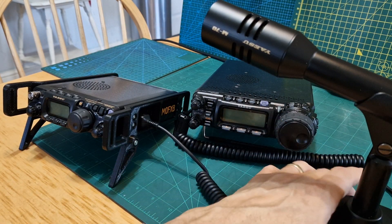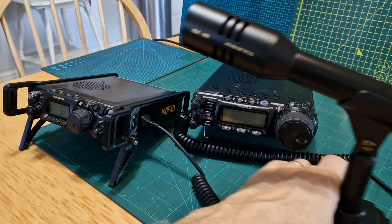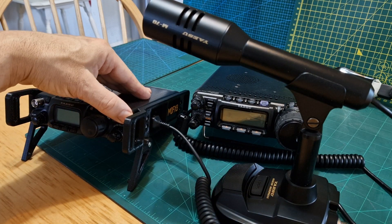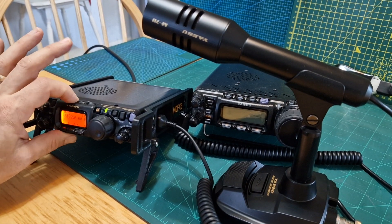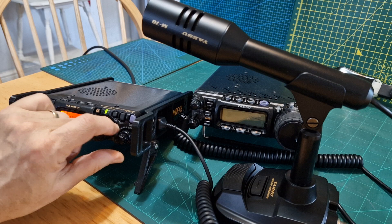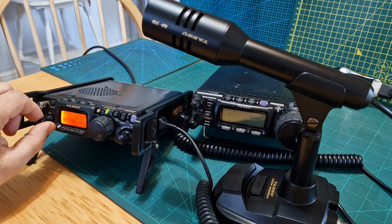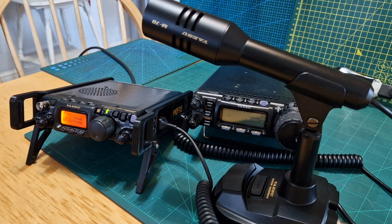There's a certain feeling that you get when you use them — it's not like using the brand-new 710, it's a different experience altogether, but still very nice and a lot of fun. So we'll just plug that in there. Turn on the 817. Let's get an antenna on there. We'll go up to the sideband on 40 meters, turn it up, make sure we've got the rear antenna selected — hold down, turn to menu number 7, turn the VFO — we're now on the rear.